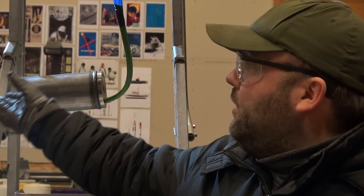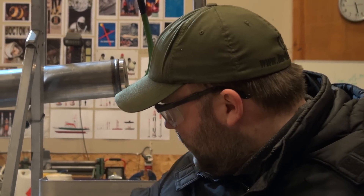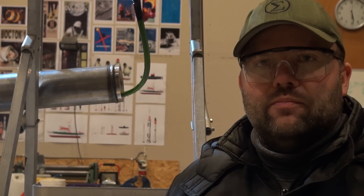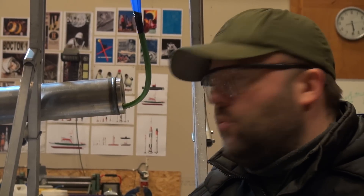It worked last time and tonight it looks like it's really working. We are filling one tube and expanding the first one to keep the process going. Right now it's expanded about two millimeters pretty uniformly along the entire six-meter length of the pipe. Once we have the correct diameter we remove the water, cut off the end where it doesn't expand uniformly, and chop up the rest into about 80-centimeter pipe pieces needed as raw materials for the metal spinning process. So here we probably have somewhere around 10 BPM5 engines or more — we still have to complete all four tubes tonight.